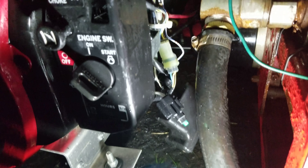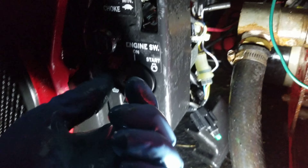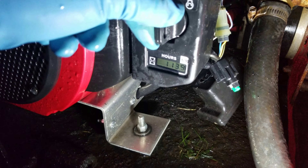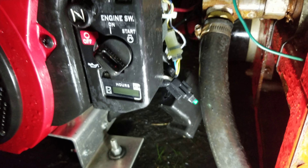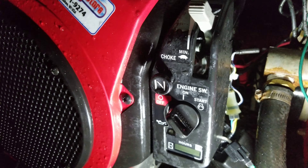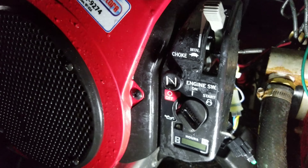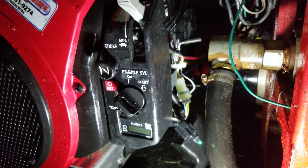We'll see how it is tomorrow — if that's great, we'll go ahead and put it back. We'll use this just as a video for my guys if we run into any issues. Beautiful noise — got 113.9 hours. Kind of weird that it tripped or burned that fuse out. The other big clue on this: the machine stopped dead when they were working, which would indicate a fuse, running out of gas, or some sort of wiring that's no longer allowing stuff to work properly.